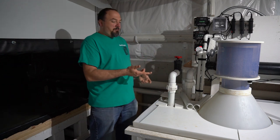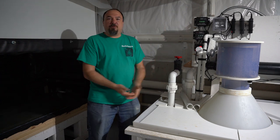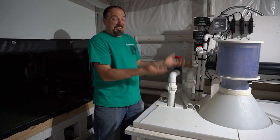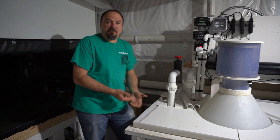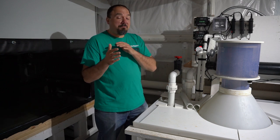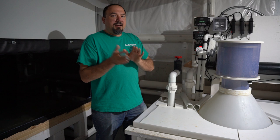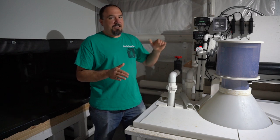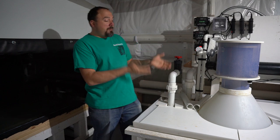When I first saw that, I checked the tank — not overflowing. Checked the floor — not overflowing there either. I closed the gate valve all the way so all the water's coming down the line and it's still not filling up, which means I've got leaks. I found a piece of plumbing disconnected, got that fixed, and pulled the whole skimmer out — which is a pretty big job. I tightened the lid down, checked all the fittings, it looked good and I put it back. But I can only get the water height to about here, which normally would be acceptable, but I really want that full height, so I'm going to have to pull the whole thing out again.